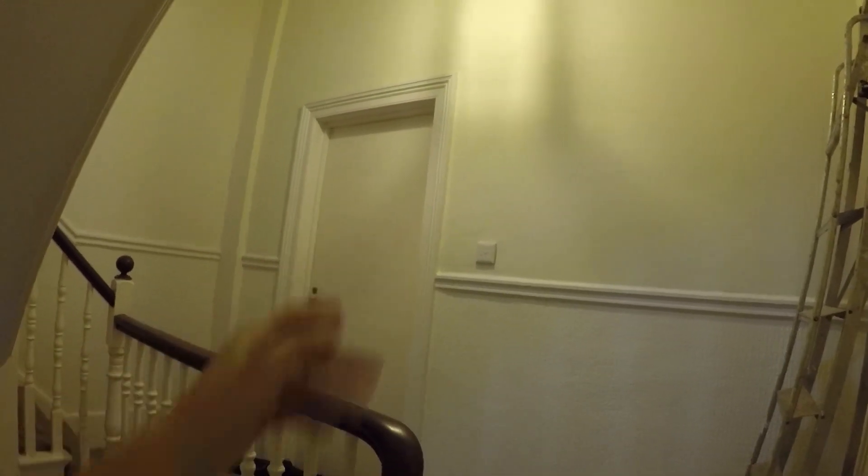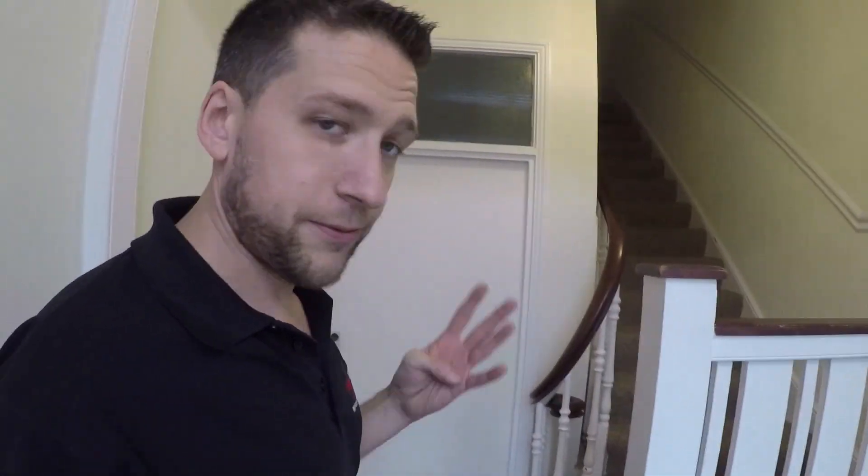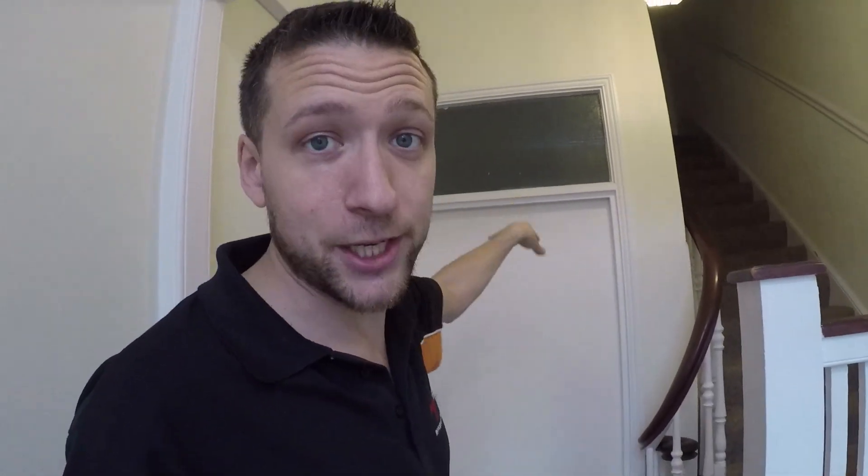There's a push button there. You could put it on sensors here if you wanted to — that's up to you. As for what sort of fire alarm system you want to install, that's completely up to you. I was probably going to fit something like a Twin Flex Pro — I fitted that on one of the last jobs I did and it worked out quite well, it was a nice system. Now it's worth noting that because this is a fire alarm system, we've got to put a detector inside each flat. There are actually four flats here, one just outside — literally underneath where I'm standing. So you've got the hallways but you've also got to put a smoke detector inside each flat.